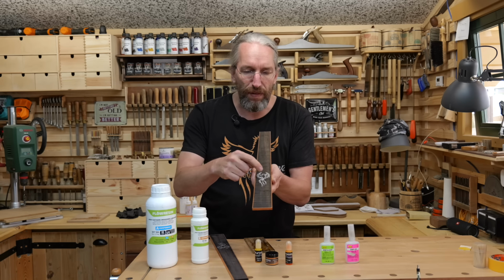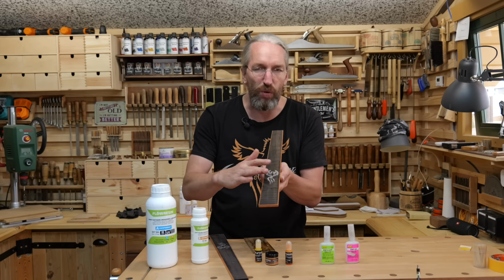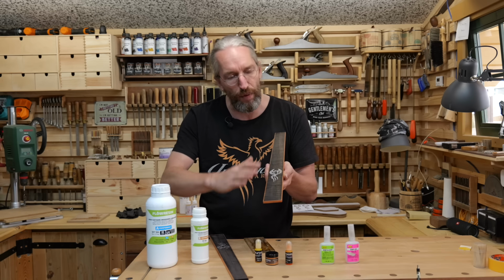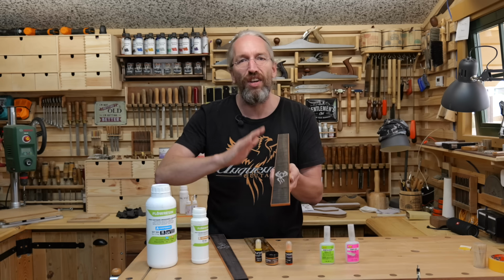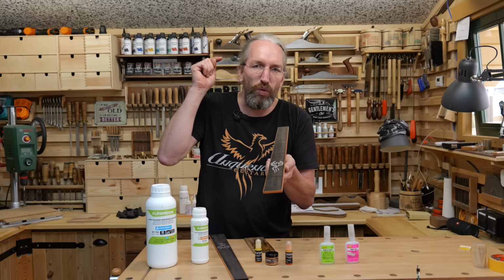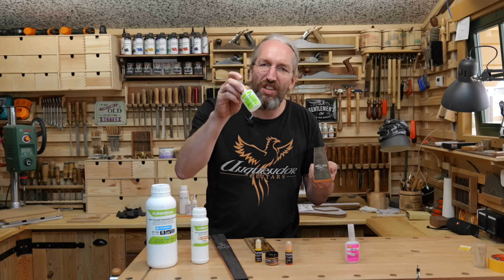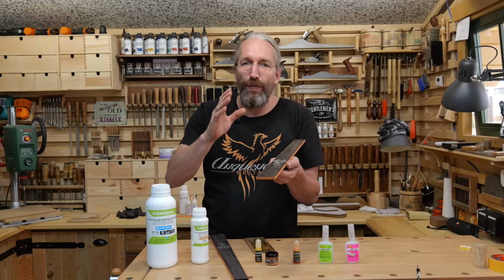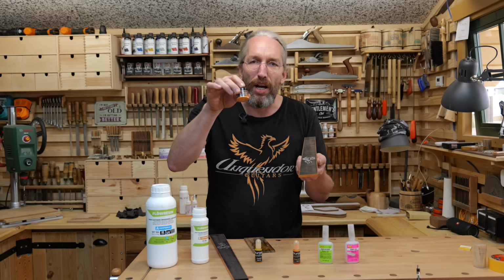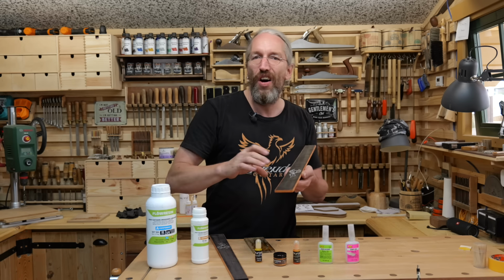And like I said in the previous clip, I'm so happy with how the routing turned out and how it looks. If it was any regular inlay, I would just flood it with CA glue, put some ebony dust on it, sand it flat, and I would be done. So that's what I'm going to do for this fretboard. I did some testing. I can stain the CA glue I have orange with the pigments I have. And for dust, I'm going to use the mica pigment, so I get a nice orange fill if everything goes according to plan.